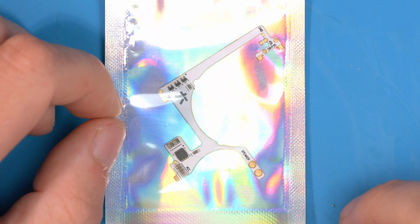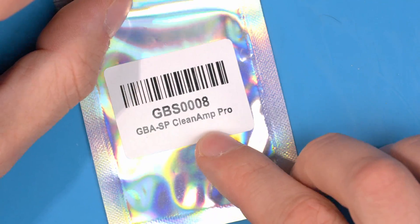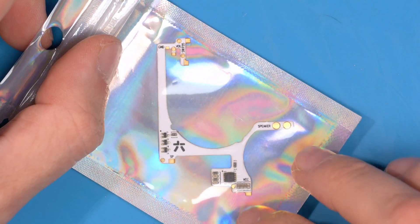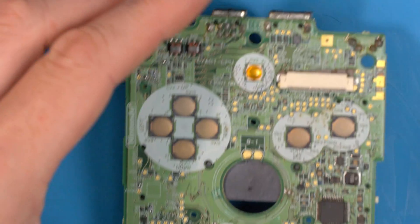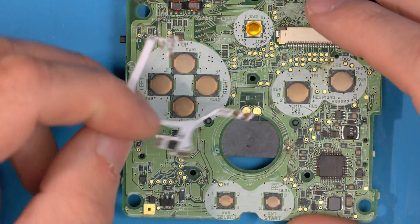With the release of our new SP shells, I thought it was well overdue that we make the wireless clean amp for the GBA SP. You can see here we have the new GBA SP clean amp — there's the SKU if you want to find it on our website — and it's nice and wire-free. It's the same amp, it's always worked, it's always good, we've sold many thousands of these. So with the SP there are two kinds, and we'll go over the install of each one.